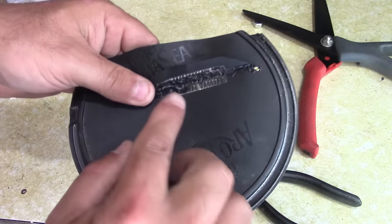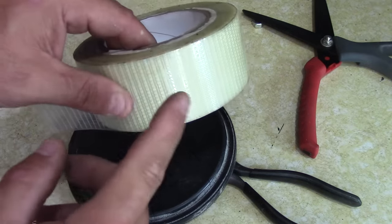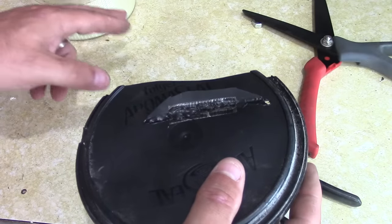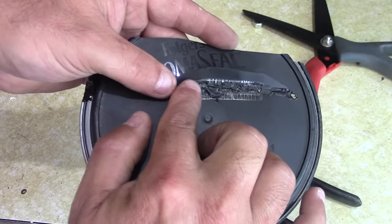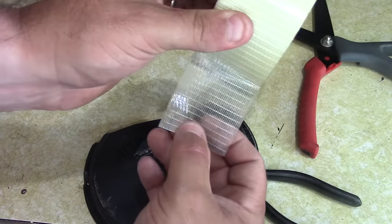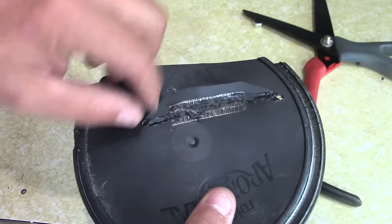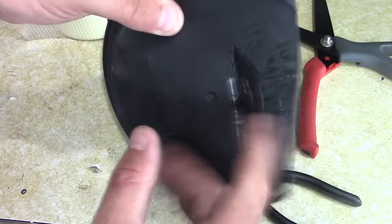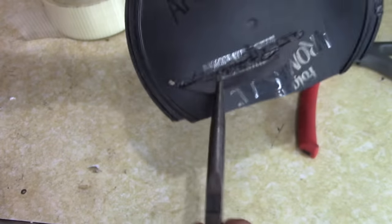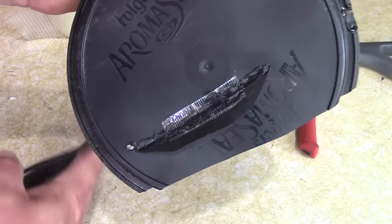So I'm going to show you what I've been working on. I'm using a lid from a coffee can, and this here is a mesh tape — it has a specific name, I'll put a link in the description. What I've done is I've taken a piece of this, cut it off, plastic welded it on, and used this fiberglass mesh tape — I welded through it and then over top of it with filler. I have this flap as a test piece, and you can see with needle nose pliers that it is really strong and it's not coming apart.